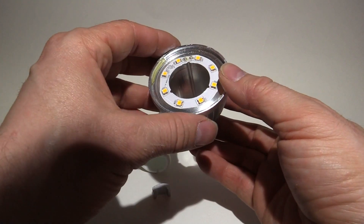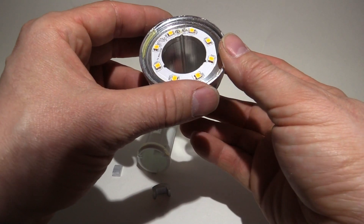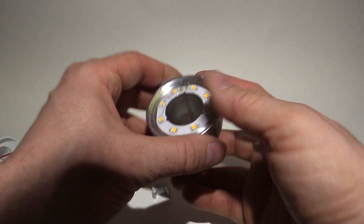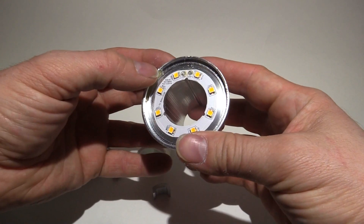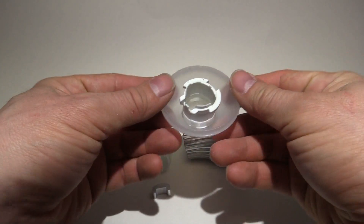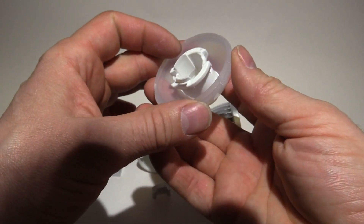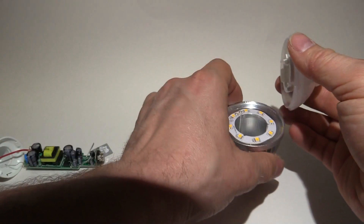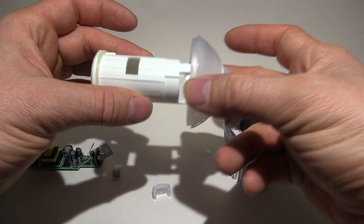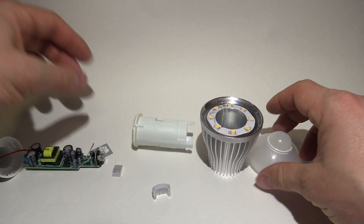The thing still works, actually pretty well. The light is reasonably high brightness. I'm not sure what actual LED chips they're using — there's no advertising literature saying it uses Cree or Philips or whatever — but it does give a nice warm white. At the end we've got the cover, which is just a standard opaque plastic with a standard PIR lens on the end. This mates up with the end of the heatsink body and clips on, sandwiching everything in and holding the whole thing together. So that's pretty much it.